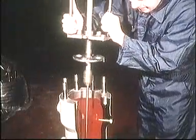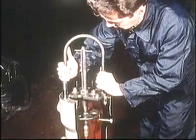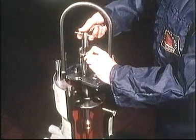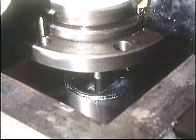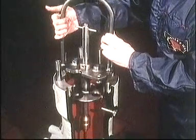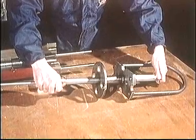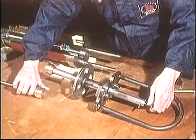Place the lifting tool on the pump housing and press down the spindle to make the measuring rod rest on the steel disc in the roller guide. Press the spindle locking ring down against the crossbar and tighten it. Then take the lifting tool up. Screw off the measuring rod and fit the lifting tool on the new barrel assembly.